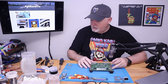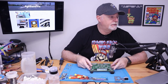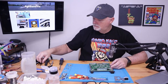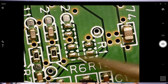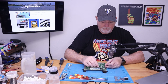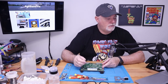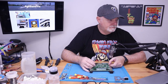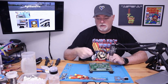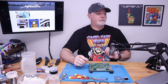In the instructions, the first thing it says is that certain motherboards need to have a resistor and capacitor removed — C22 and R14, which are right there. R14 is already missing on ours, and C22 is also missing. Just for reference, these are the first two right off of the accessory port that was meant for the disk drive that never came to America. So we don't have to remove those. Normally, you'd heat your soldering iron to 400 degrees, put a little fresh solder on them, and they'll pretty much just wipe off the board.